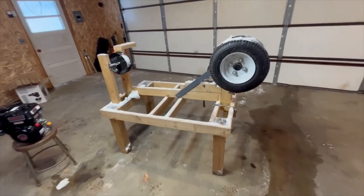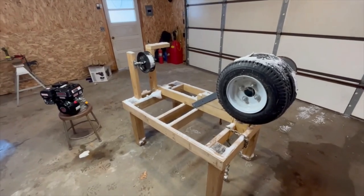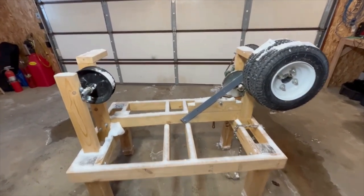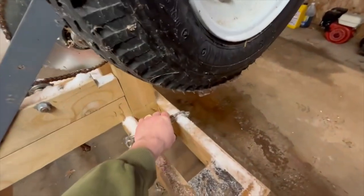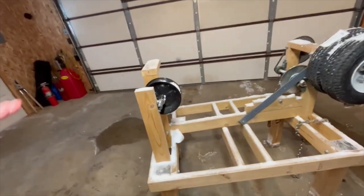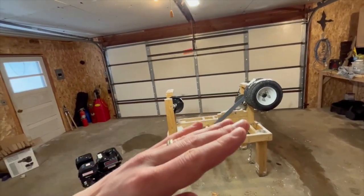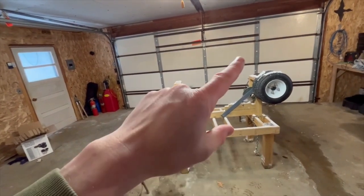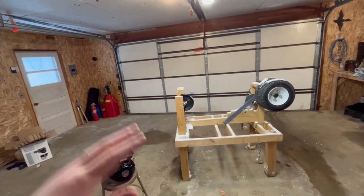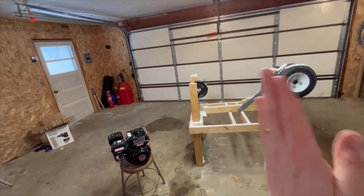If you're not familiar with this, I built this a couple years ago. I have a video of it running last time I had it out, but I robbed the motor off of it. I got a brand new one here. What I'm going to do is redesign this a little bit. I had the anchor hooked up to a tree, so the rope comes in at this angle, and what that wants to do is basically tip it when there's any major load on it — the back end likes to lift up. So I want to create a tie point on the top part and reinforce it, because this top post kind of scrunched in a little bit.